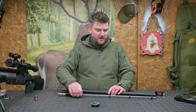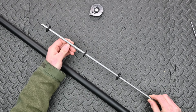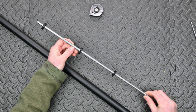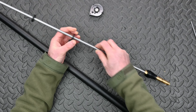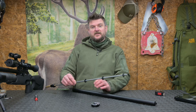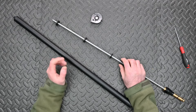This is a smooth twist barrel liner and you can see the spacers on here — there are three spacers that go on it. On the liner here, this is an FX STX superior liner and it's a 1-in-24 inch twist rate. The impressed internal rifling can be seen on these external grooves here. Of course FX do offer liners in all sorts of different specifications depending on barrel lengths and whether you want to shoot pellets, slugs, or heavy slugs. So that's another thing you can experiment with if it suits your tuning desires.